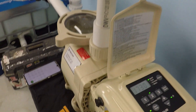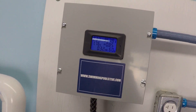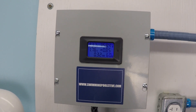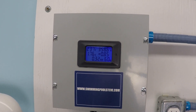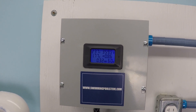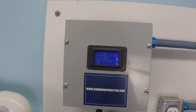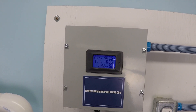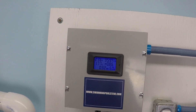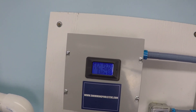It's already running at 1,730 — that's as close as I can get it, being conservative and going over. So it's actually just a smidge over half speed. Under these conditions, it's currently drawing 1.76 amps, approximately 358–359 watts. In some previous videos that I've made, that wattage number might have looked different because it auto-adjusts under heavy load, and the decimal place will move three places to the left and it will become kilowatts instead of watts. But because this pump is using very little power right now, it reads as watts — so about 360 watts, or 0.36 kilowatts.